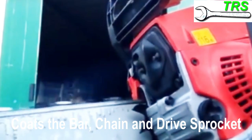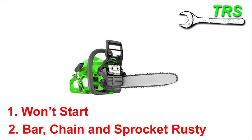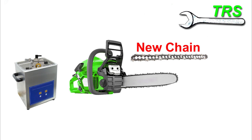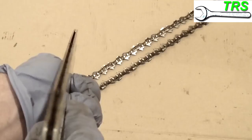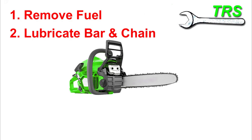I know these two things may not seem like much or like rocket science, but if you were to store the chainsaw and face these problems when you come to use it again, and then took it to a dealership or repair center to have the carburetor removed and cleaned, and maybe a new chain or a chain sharpen and a clean or a service — believe me, it's much easier, better, and cheaper to drain the fuel, run the machine until the fuel pipes and carburetor are dry, whilst making sure the chain, the groove of the bar, and the sprocket are well lubricated and free from damp or moisture.